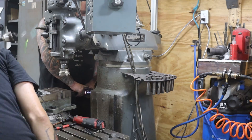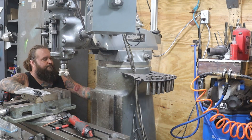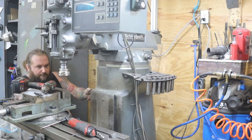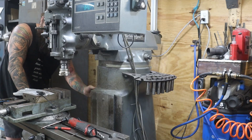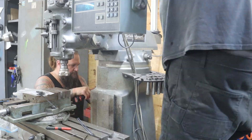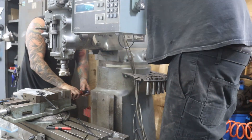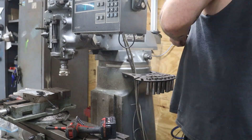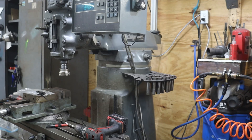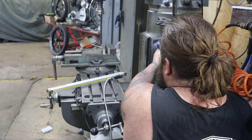This mill came with a two-axis DRO. I had a three-axis on the other machine. The DRO on this machine is a really high quality one, so I didn't want to lose that, but I also didn't want to lose my third-axis DRO. So we decided to just drill the mount that holds the current DRO, install our old DRO screen, and install the glass scale to give us our Z digital readout. So we just have two screens — not really too big of a deal. I had all this stuff already, so it keeps us with all the features we're used to having, while having a much nicer mill.